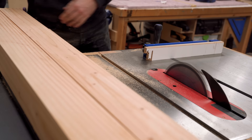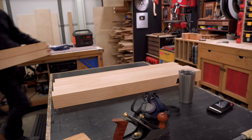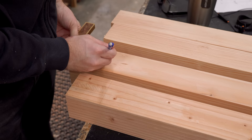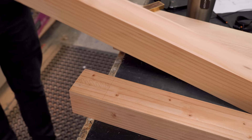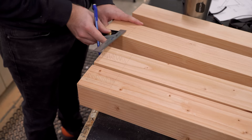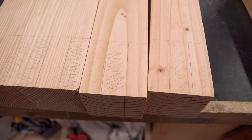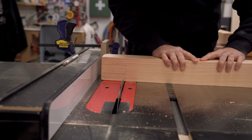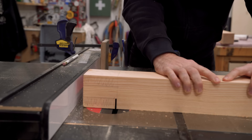I'm not cutting these to length yet - I'm just squaring up the ends. I'll cut them to length after I've done the joinery and I'll explain why in a minute. So these posts are going to form the brackets that support the weight of the awning - basically like shelf brackets but on a much larger scale. Since this is going to take quite a bit of weight I want to make sure it's nice and strong, so I decided to go with a bridle joint which not only looks good but also provides quite a bit of strength. I laid out all four posts with pencil lines so that I didn't get confused when I went to cut it on the table saw, and I can use those pencil lines to set up my first cut which is going to be the shoulder cut.